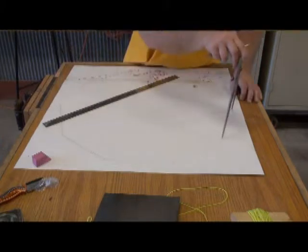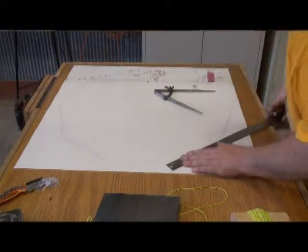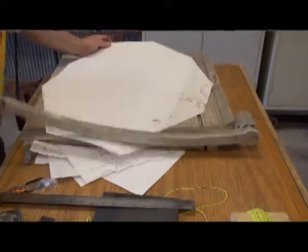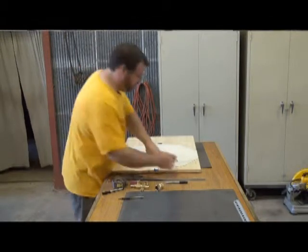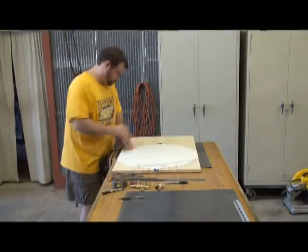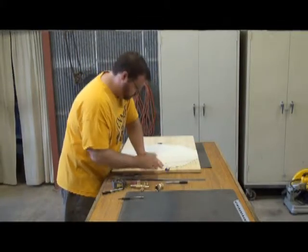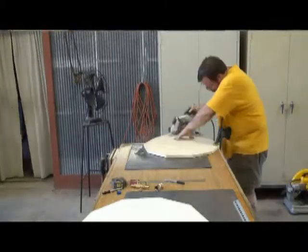Mike then uses the 7.81 inch wide steel plates that will be the worm bin's outer walls as a guide to finish drawing the decagon template. After all the dimensions are double checked, Mike trims off the excess paper. Place the decagon template on the 2 foot by 3 foot wood panel. Make sure 2 flat edges of the template, being 2 foot apart, sit flush with the sides of the wood panel. Once the template is properly situated on top of the wood panel, use the pencil to trace the template onto the wood. Next, Mike uses a circular saw to cut off the excess wood.